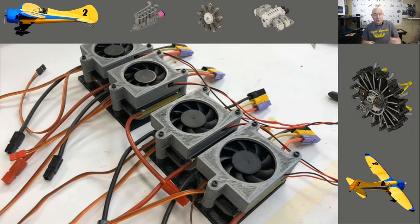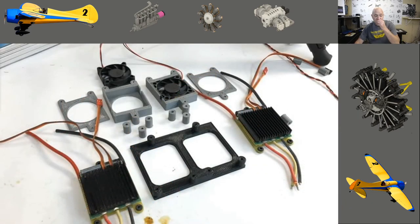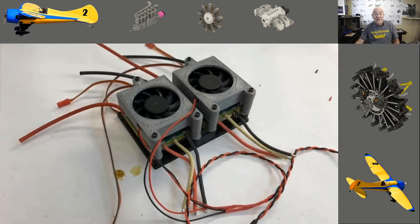If you go too far out you can get a timing issue with how the motor starts, but I've tested this system at eight feet of wire on each ESC to the motors and it worked flawlessly. I'm not going to have eight feet in this airplane, but that's what I tested. I 3D-printed some parts for my speed controllers and put fans on them. These fans will plug into a completely different battery circuit to cool the ESCs when there's no airflow through the intakes on the fuselage.